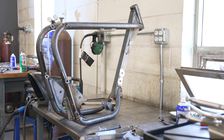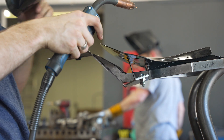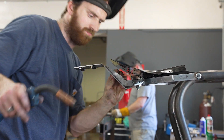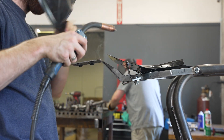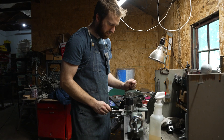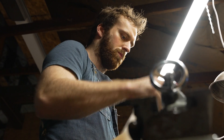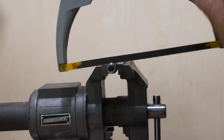The first part we start with is the center bracket for the Pillion seat. This is a two-part assembly — the first part is the actual seat part itself, and then we have a bracket that mounts to the top part of the frame that bolts everything together. The bracket has a couple of bent parts, a couple of quarter-inch thick parts, and an eighth-inch thick part. I grabbed a production frame to set everything up as a fixture, bolted it up like it would be assembled on a bike, just a frame pulled off the shelf. That way, when we're finally done and ready to assemble everything, I know it already goes on a bike because it got stuck together while it was on a bike. We also jumped over to my shop for an afternoon and machined a couple of little pieces to fit inside the frame bungs — those just transmit the torque of that bolt nicely into a solid piece of metal instead of on the edge of that part.